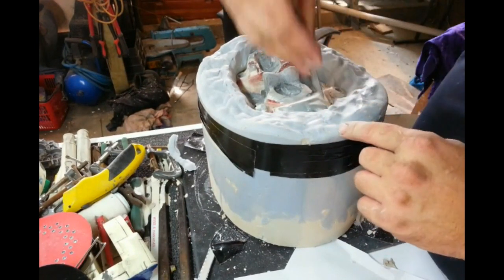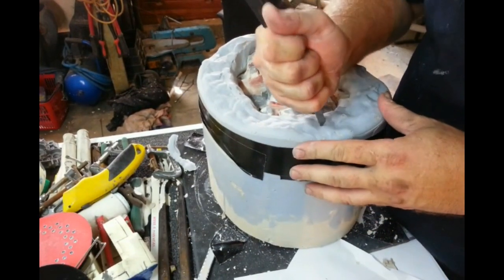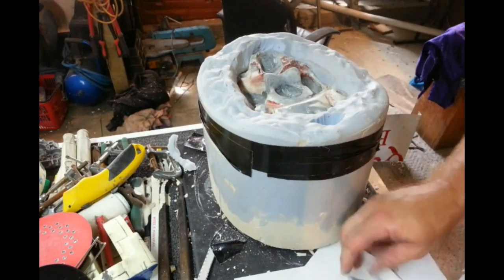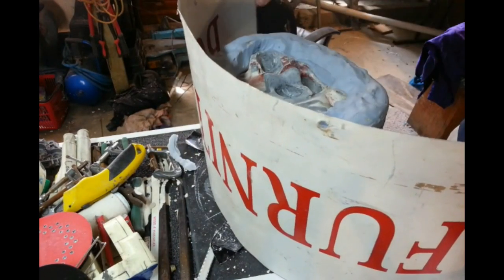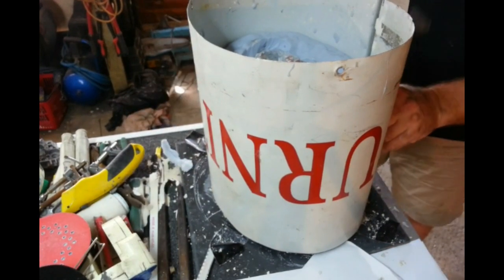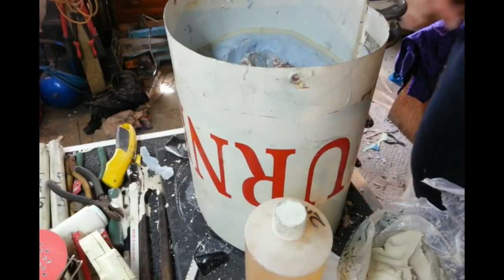The one thing I am going to add here is just a wedge cut out of this — that's where I had to cut the mould unexpectedly. You can see the movement there. So I'm just going to cut in a key-way piece in the centre of that. I'm now going to re-box that and mix up some more silicone and pour it in. I'm just going to use that same sheet of tin, making sure it comes back to the same seam line position. I've run some clay around the edge to make sure the silicone is not escaping, and then that one is just about ready to pour again.